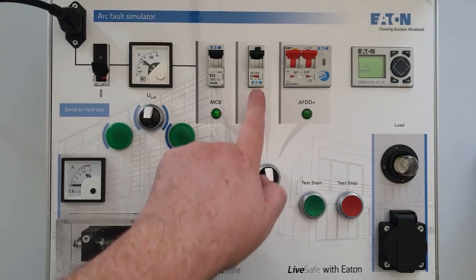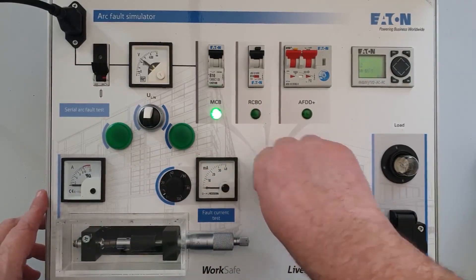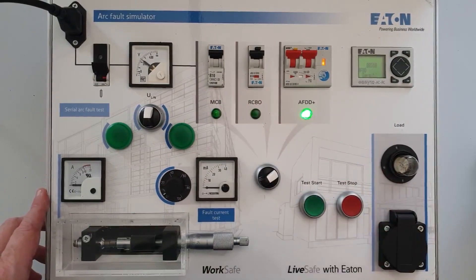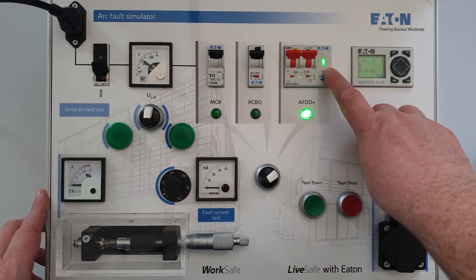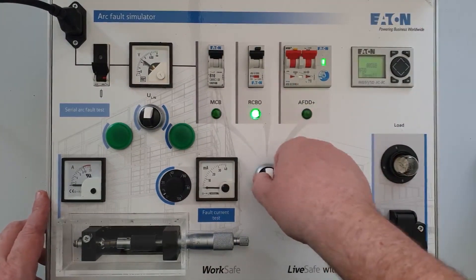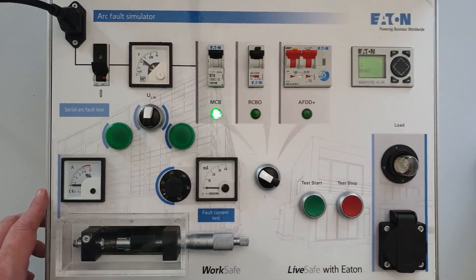We are right now selected to the RCBO. This is a steady light — it's just flickering due to the camera. We have MCB protection, RCBO protection, and your AFDD, going through the cycles and giving us the green light to say it's still suitable for use. First thing I'll do is give them a test, verify they work. RCBO as well. I obviously don't have that freedom with the MCB.